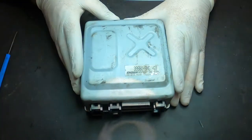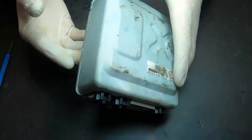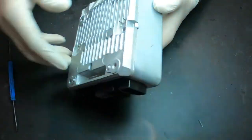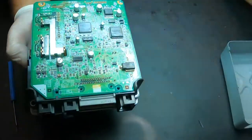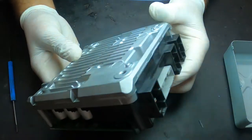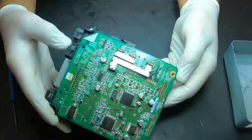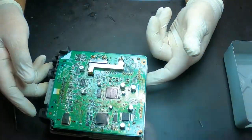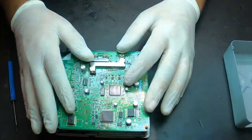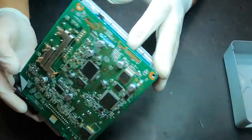Let's open this and see what the problem is. The symptom feels like a relay — it feels like a relay not clicking. I already removed the screws, opened the little tabs by bending them out, and popped this open. This is what it looks like inside. After close inspection, I found we need to separate the top board from the bottom board to actually access the relays.